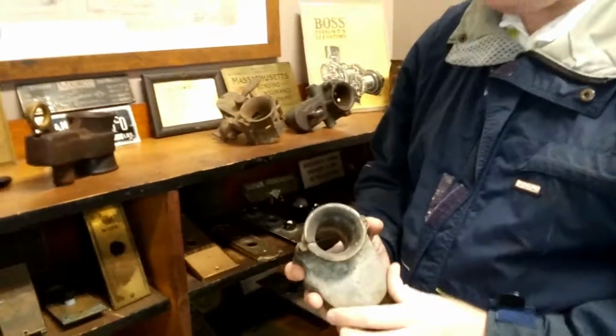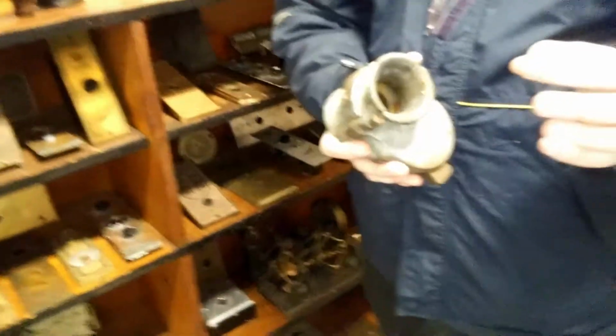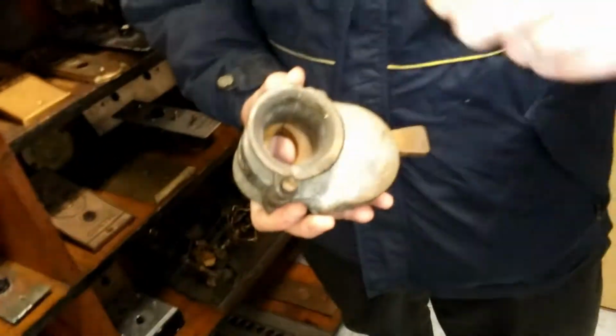I think here we go. So they'd use these for the pull-rope ones. Yeah, and there are beads in them. I think you might have seen that. So the rope goes through. Yeah, and if you want to stop at 4, when the bead comes, it will catch a bead and pull it and shut off the elevator.